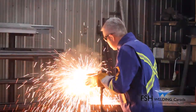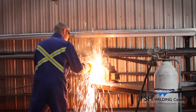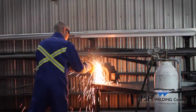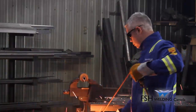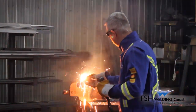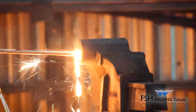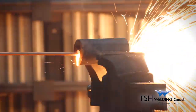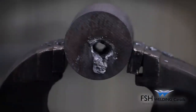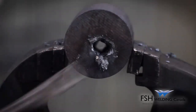The PrimeCut system is an excellent tool to remove seized pins or shafts — this is the most common use of the system. By using the variable control valve to regulate the flow of oxygen, it's possible to pierce most materials safely in all positions. The heat introduced into the pin shaft followed by the cooling down allows the pin shaft to be efficiently extracted.